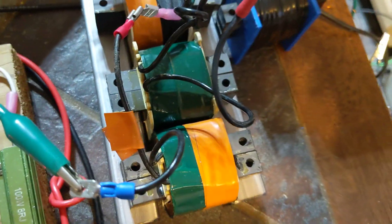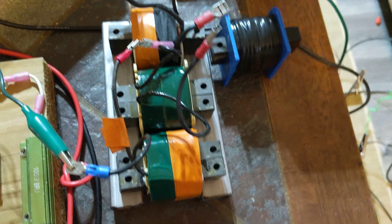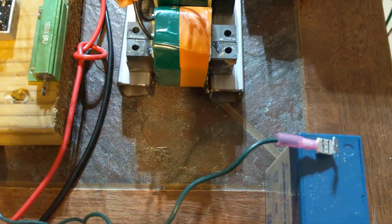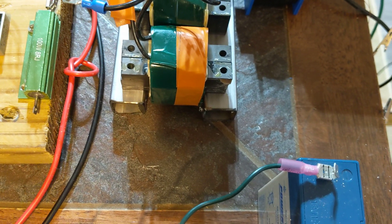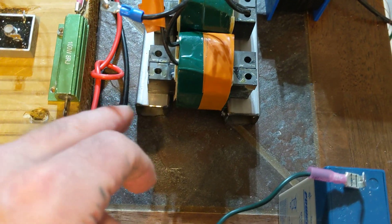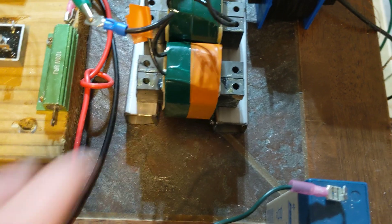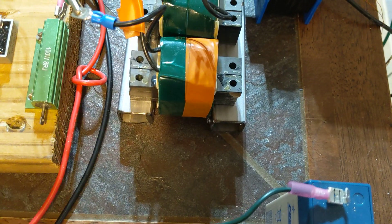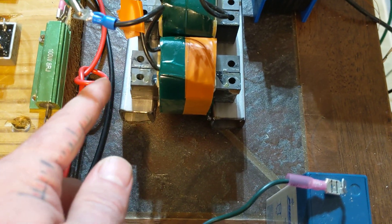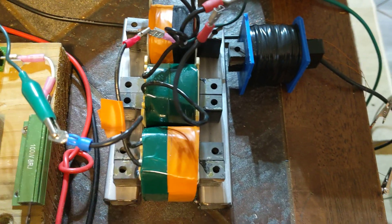That's all with just one pickup coil. These coils need to be in series — or there are probably other configurations that would work. You can't connect the ends of the bars though, because you have a north and a south switching. If you connect the ends of the bars and close it like a transformer, the magnetic field no longer grows because it grounds back into itself and loops. You don't want it to loop — you want it to have to take the path through a transformer or electromagnet to get to the other side.